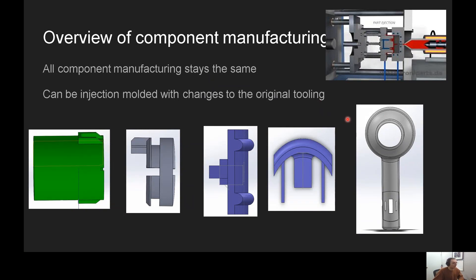My goal was to keep all components injection molded. I just needed to modify some of the tooling for injection molding, and all these components will still work as injection molded parts. You can see all the planes and pulling directions — just pull from left to right on these two components. I had a couple of redesigns but this one seemed the easiest to injection mold. Adding draft angles to the tabs that stick out would be better, but that's an easy thing to do. Adding slots in the shell really does not affect manufacturability, so I was super happy with that.